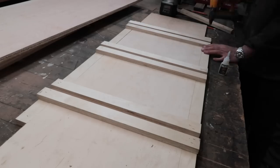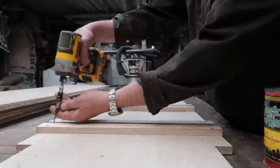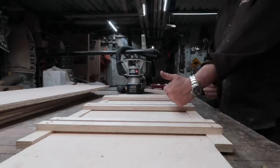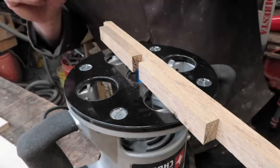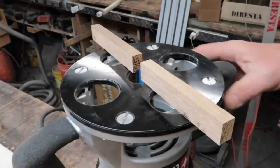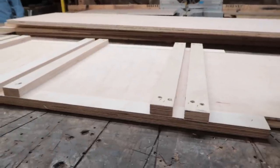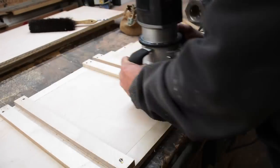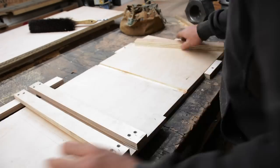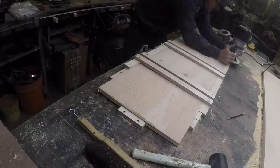I'm laying out a spacer — these are going to be the rail systems I'll use with my router to cut a very specific dado. I secured them by gluing and nailing them in place. This is sort of my system — I've never really seen anybody else do it. The idea is to glue a guide exactly the width of the router bit, about a hundred-thousandths wider than the router bit, otherwise it would just plane the inside of the jig. So you have to be sure the router bit is not rubbing the inside of the guide, and you can see how I use the router on that jig to create a slot.